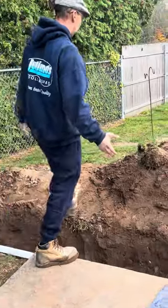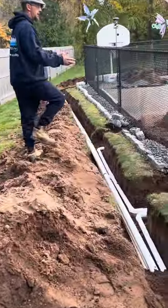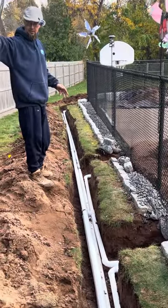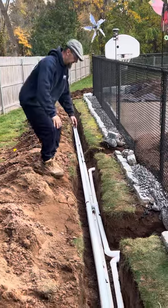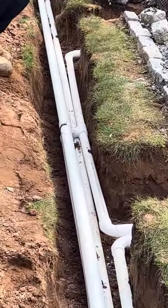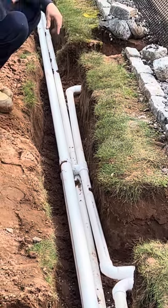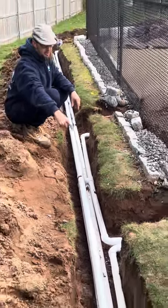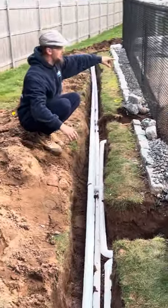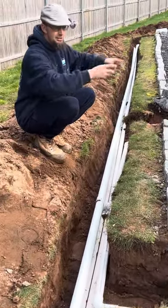One thing I want to point out right here for our stair lines, this is real important when you're plumbing stair lines. We got our main feed line coming out, and it comes right down here to a T fitting, and then from there it disperses out evenly to both jets. You don't want to just run a T there and run one out and then have another 10 feet of pipe going that way. The water pressure won't flow evenly out the jets.